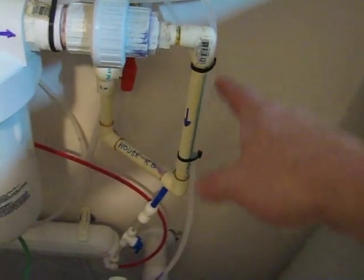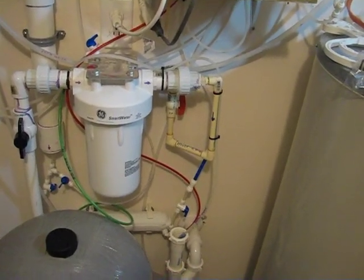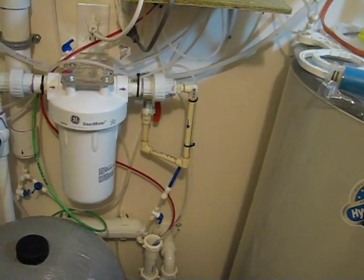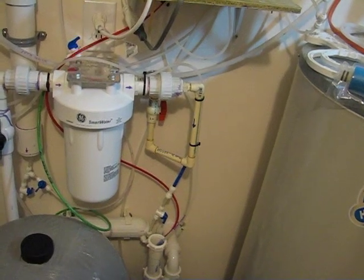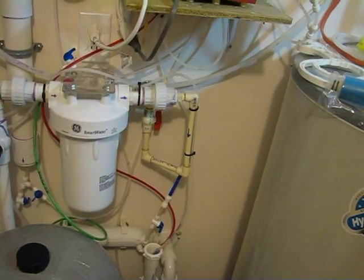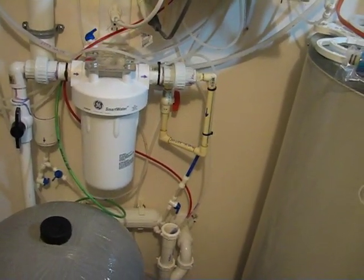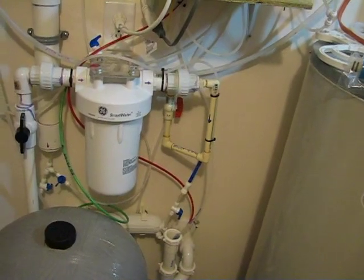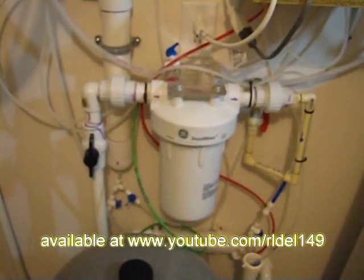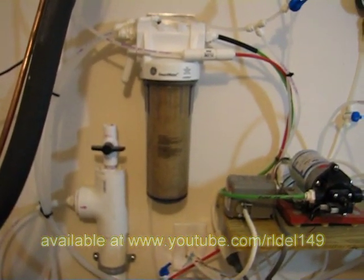Our little piping goes through the entire house — every sink has a separate little RO tap, plumbed just like another sink outlet. All that pipe is dirty when it first goes into service, with germs, molds, mold spores, and dirt. There's no way to clean it by mixing bleach back in, because bleach and membranes don't get along. Part of the job of the pre-filter is to remove any chlorine.